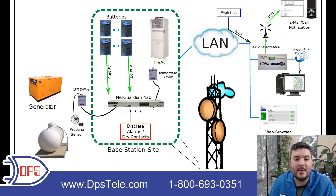The signal comes home and that's being picked up by the NetGuardian RTU inside the hut. The NetGuardian, or any RTU you're using, is your central collector out at your remote location. So we're not only picking up propane, but many other things. We're picking up discrete alarms, which are also known as dry contacts, and we have 20 inputs on the NetGuardian 420 — that's what the '20' is for. We're bringing those in from all sorts of different equipment alarms and miscellaneous sensors like door, motion, and smoke detector.